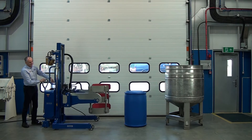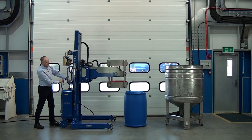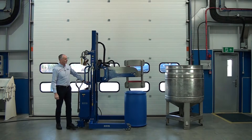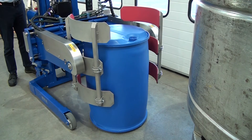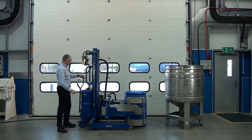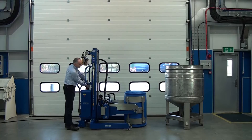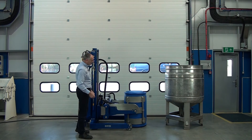Lift the head over the top of the drum, then lower down. When you lower it down, just lower it so it fits between the bands — you can adjust the forward and back. Bring in the clamp again. You monitor this clamp pressure meter — it's in the green. I can see the bands around the drum, so I'm ready to lift.